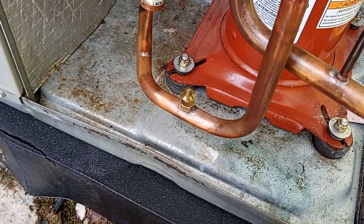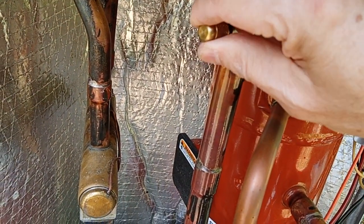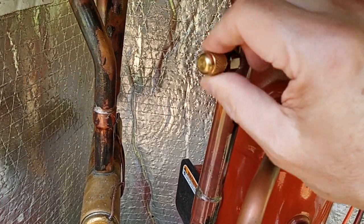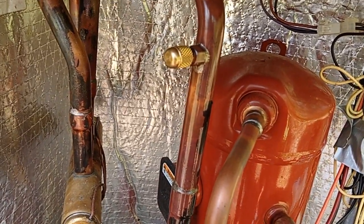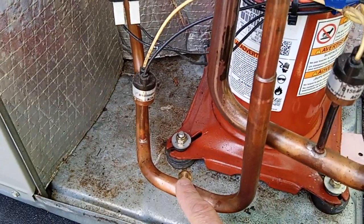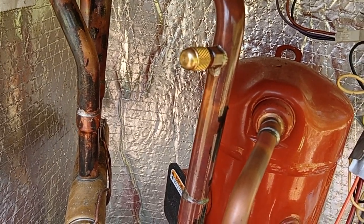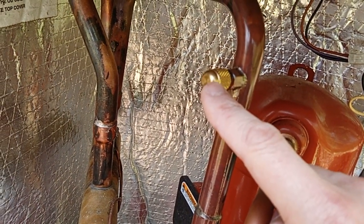So what has to happen is this. For the other ports that aren't leaking, put on proper seal caps. That's from Grainger. It's a nice knurled brass cap with a nice big rubber seal inside. Tighten it down so that little tiny bits of leakage that normally occur won't happen. But see, that's not going to stop it permanently. So after I fix this thing, what I'm going to do is what should be done on all these caps, and that is Loctite the threads with low strength Loctite. It's easy enough to get it apart later, just simple hand tools. But then that seals the threads and guarantees there can't be leaks when the Schrader valve in here fails and when the seal in here fails, because that seal's rubber.